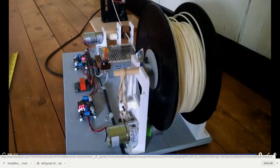Get a bank of 4 of these things, and then you can have a heavier motor, and that heavier motor could be run. It would actually be easy to use the universal controller that also is connected to this, so each one is feeding the exact same speed. No, it's a common hopper. You have to have all your extruders. You can't really bank it up too much unless, how do you make it extrude at the same speed? You don't. Couple and decouple it. I mean, you have to have 4 independent systems, really.